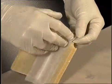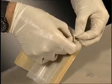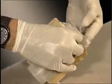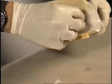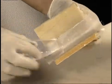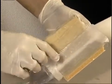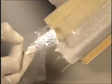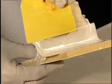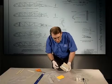I should have brought my tweezers along today. Just about getting it here — there we go. So we peel off the outside plastic. Be very careful — you can see it's lifting up a little bit here. We want to peel it off in a way that we don't disturb the fabric underneath; that just takes a little bit of practice. Use your squeegee to smooth out any issues, and we end up with a really nice layup.